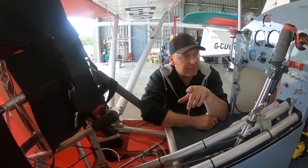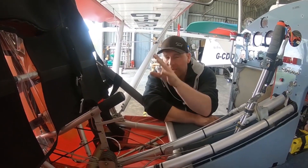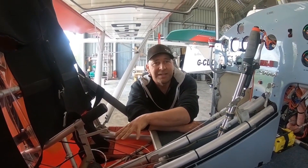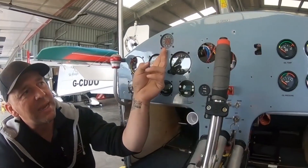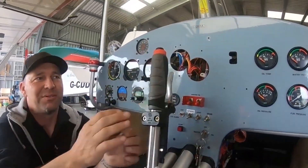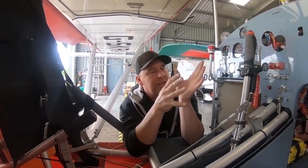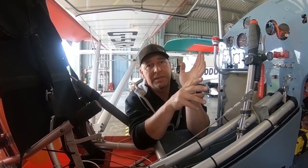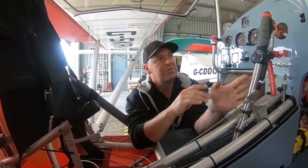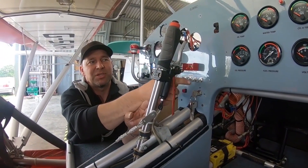We've cleared out everything we needed to do and identified cables. We've sourced power for the avionics system that we're putting under the seat — if you've seen any of our Facebook channel footage, you'll know we like to do that. We've got the head unit back in, the DI has been recalibrated, and we're just reorienting the iPad holder. We uncovered some lovely holes there to contend with when putting it back. We're going to put the iPad holder back in and then look at fitting the USB auxiliary power supply. We have concerns that plugging into a USB port could leave cables around switches.